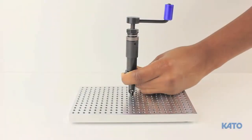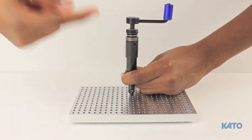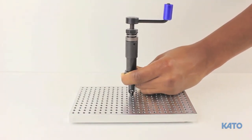The idea here is to set the clutch to use the minimal amount of torque that will install the insert. Before we begin, make sure the clutch is set to the lowest setting by loosening the lock nut. You want to hold the pre-winder body — do not touch or hold the body of the clutch drive. Hold the pre-winder vertically over the hole and turn the clutch drive using the handle.